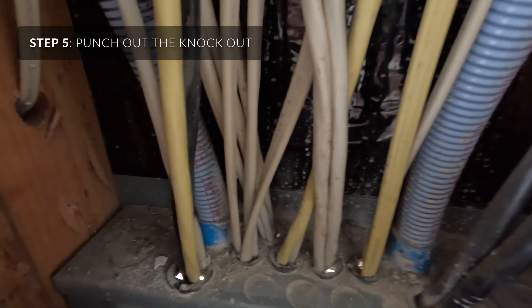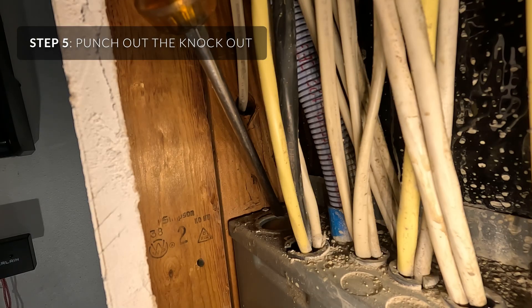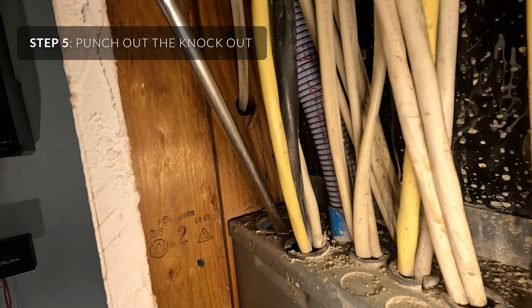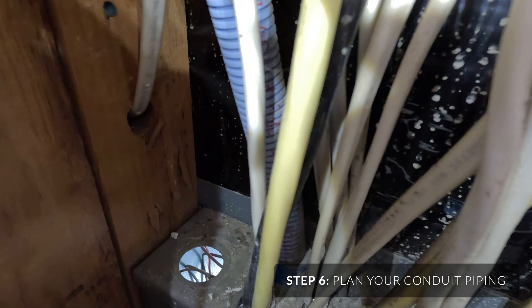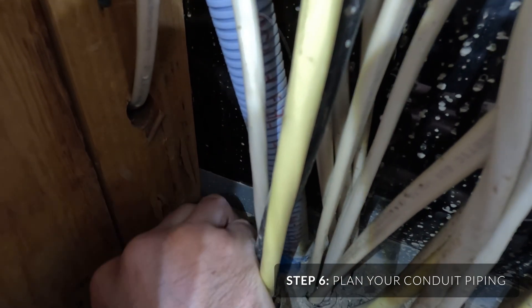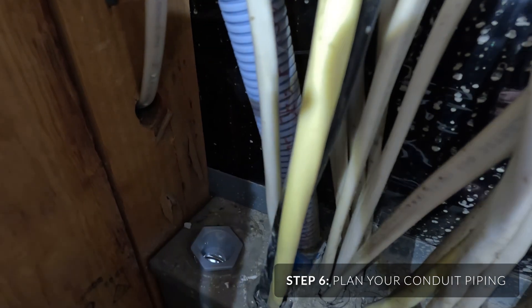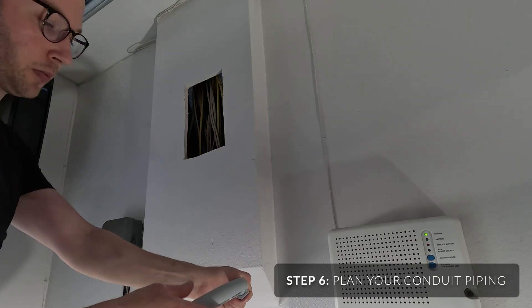Turn off the electricity. Make sure that the panel pop-out is clear on the inside. I just tapped it on the edge where I figured the spot weld wasn't. There's the hole, and here's the one-inch adapter to three-quarter pipe. It's going to sit something just like that. I put the bend inside the adapter all the way.